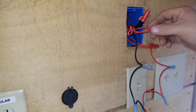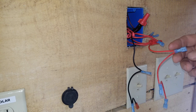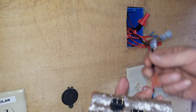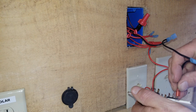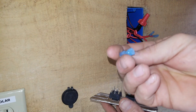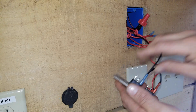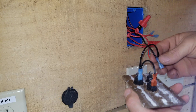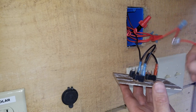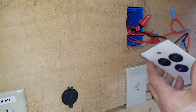I've got all my connectors on — these are on the switch legs, the negative and the positive. Now all we need to do is hook them up to the switches. The black wires are going to go on the brass connections. This one's a different color — I just messed up and had a red one left, so I used it. It doesn't matter, it's the same thing. I'm going to use the middle terminal for the line side and the other one for the load side.